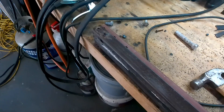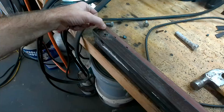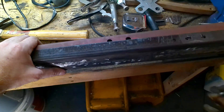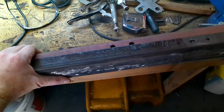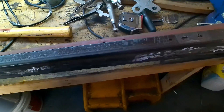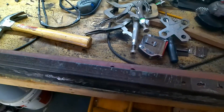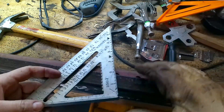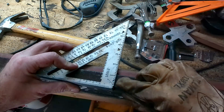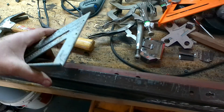There are a couple things I'm doing. First off, I'm going to mark the location. I'm going to get this pressed in just using my vise and bearing on it a little bit because it's gotten a little bit twisted. You can see not much of the holes are exposed, so it's pretty parallel. I'll take my square and line it up to the edge, and put a line there.